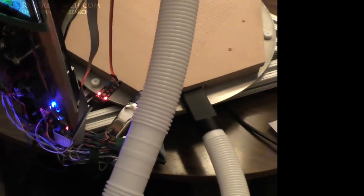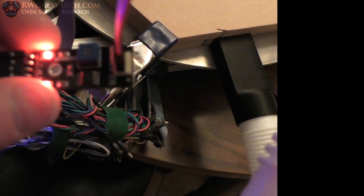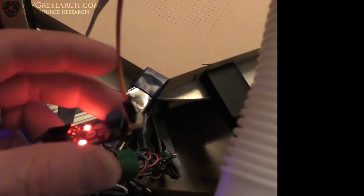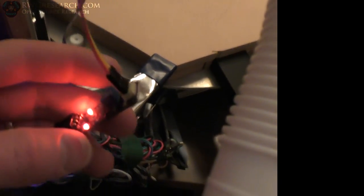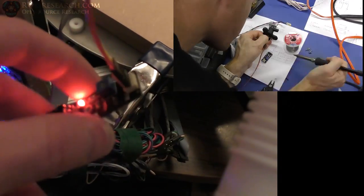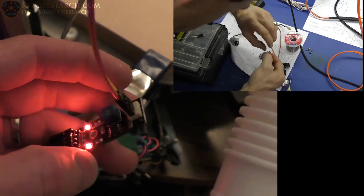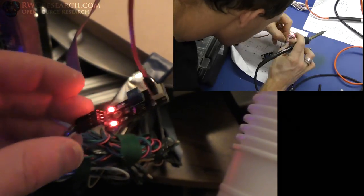Alright, boys and girls, so I recorded everything I didn't need, and I didn't record anything that I tried to record. So I referenced this little chip, and this is a SAINSMART board, and what I did is I took the hall sensor off and placed it within the end of that thing, and then put some jumpers on the end of this guy, and now I'm using it as an end stop. But I'm using the hall sensor remotely with just wires to save space on the actual unit itself.